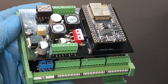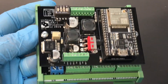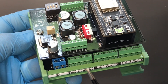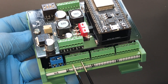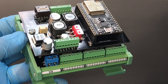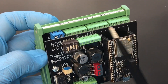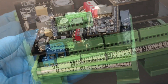Talking about the base board, it's broken up into two banks — the A bank along the bottom edge and the B bank along the top edge. The A bank is fed by the VA terminal, and likewise VB for the top set of terminals. The I/O terminals are numbered 1 through 6, and each of these terminals has eight pairs of I/O. What's cool about the dual bank design is you can power these terminals with two different voltages — for example, the lower edge driven by 24 volts and the top edge by 12 volts for a mixed voltage brewery controller design.